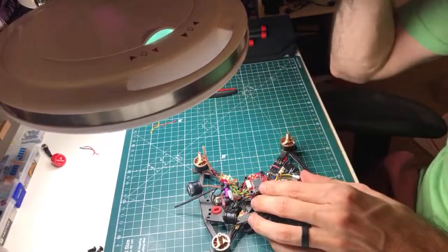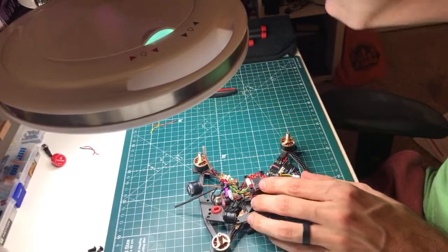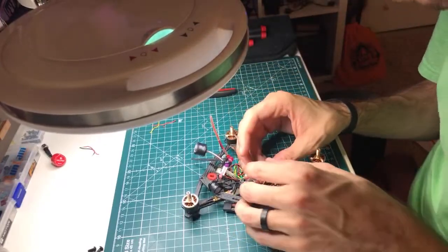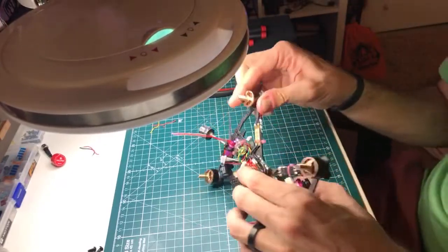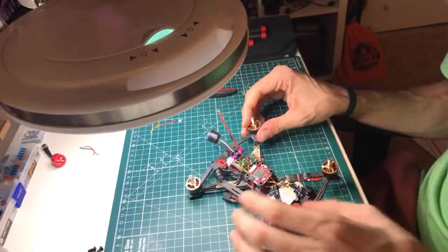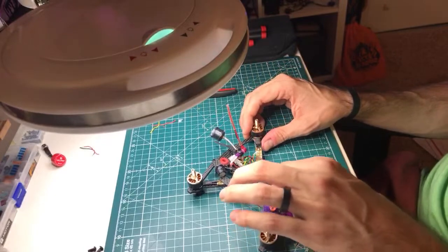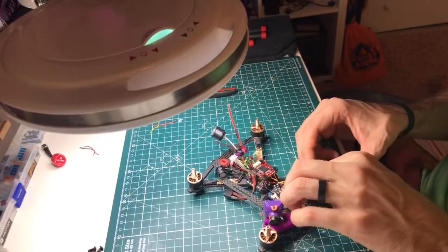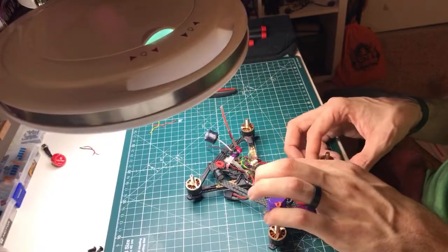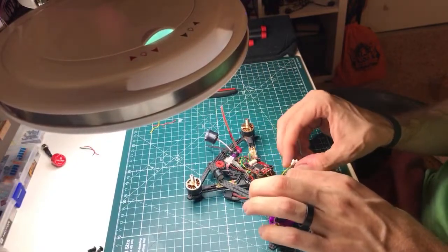The Pro32 is a 5 volt VTX. Right. I'm used to Tramps. I've been cheating on the micro game quite a bit in the last year, guys and girls, and that is a byproduct of that. I'm used to running full voltage to Tramp VTXs.